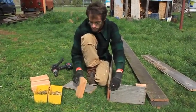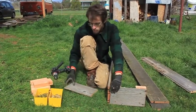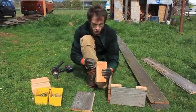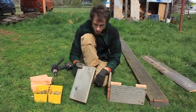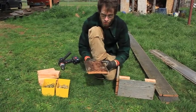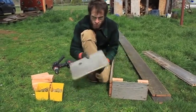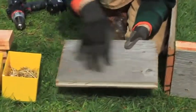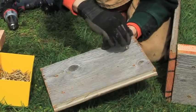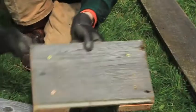Bruno is such a helper! I pre-cut a few two-by-fours - just Douglas fir, the standard two-by-four material. The reason we're using this instead of more barn wood is that it's new and fresh so the screws won't split it. This barn was constructed from cedar and it's been around a while - you can see the silvering. Quality wood, about 80 years old, not rotten. But we want something new and fresh for the screws to really bite into. I pre-drilled this board because it's so short - the way the grain runs and how it's sun-baked, if you just put the screw in it would crack along the grain line.